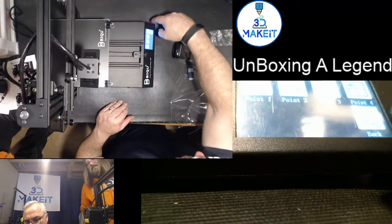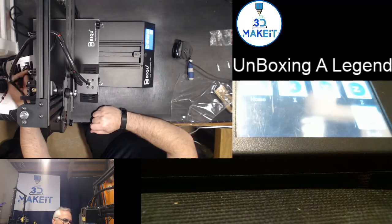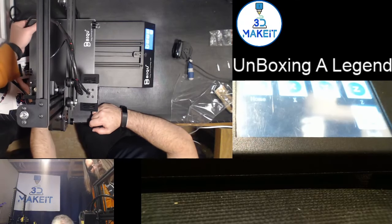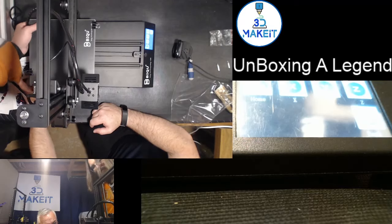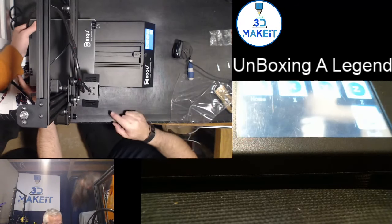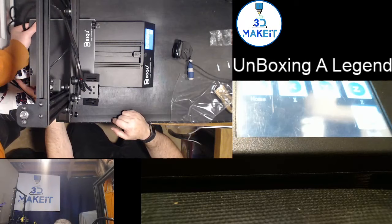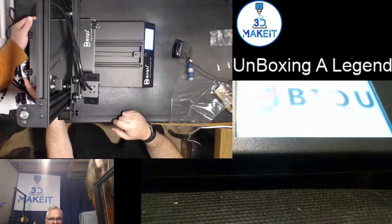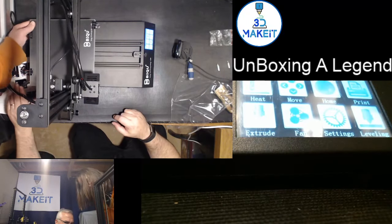Okay, so let's home this first. All right. It's been a long time since I heard an A4988. Oh, this? You went the wrong way. No. Yeah, you did. I went to the right. Well, this one's all the way maxed. Yeah, that's the way I turned. It must have bound on something, or the screw's just spinning. That's what it is. I can see the screw spinning underneath. There, that one's up. And it just shut off. Halfway through homing, it just shut off.